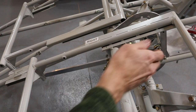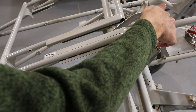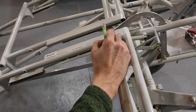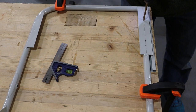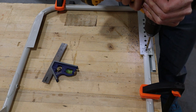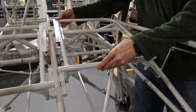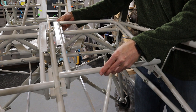Next I marked the location of the pin where the seat was fully forward, again with the seat fully aft, and then evenly spaced holes between the two points. Later I found out the designer only intended the seats to travel three and a half inches, so I will be plugging a few of the front holes to keep the seats from interfering with the control sticks.